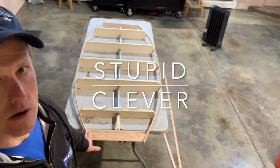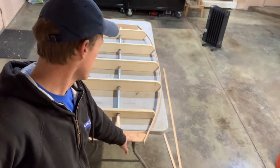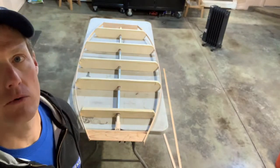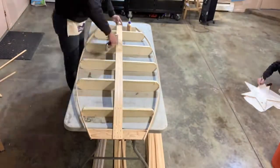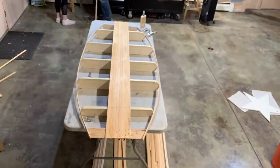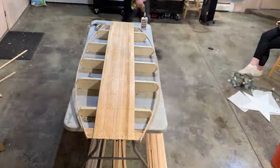I'm next going to start all of the flat horizontal pieces from the nose, starting from the middle of the nose out on each side, and then gluing on the transom. These should be about a foot and a half of strips that should go on really quick. When each strip is applied, it is glued to the strip next to it and to the transom and to the nose, but it is not glued to the forms. The staples are the only thing actually holding the wood strips to the forms. There is also a layer of masking tape over the forms to prevent glue from binding.